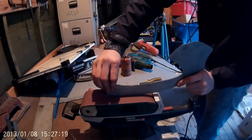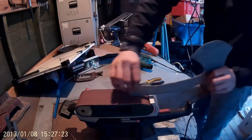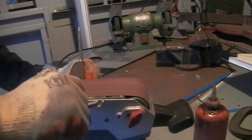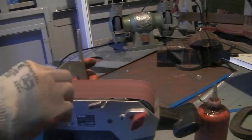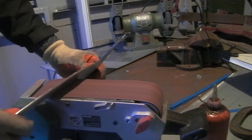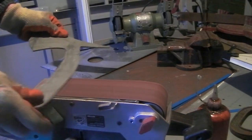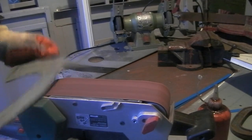Once it's complete, you're ready to start sanding the metal. This part could also be done using a file, but as we have the tools, we will be using a belt sander. Sand down all the edges until any rough or straight cuts are smooth to the touch. This gives the tomahawk a better look as well as being easier to hold. Then file or sand down all corners on the hilt so that all cut edges are smooth and nice to hold. You could slowly change to a finer grain of sandpaper or file until you get a really smooth finish. As we'll be adding paracord, we chose not to.